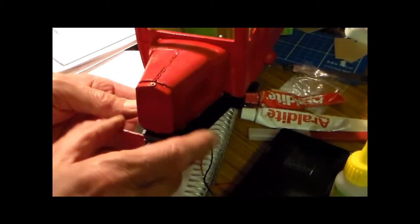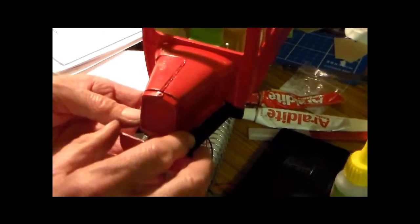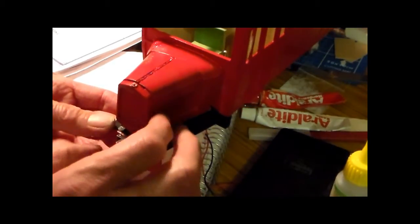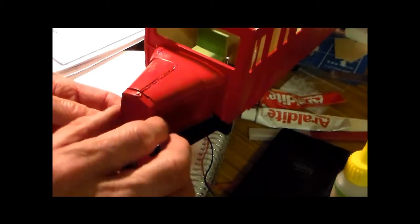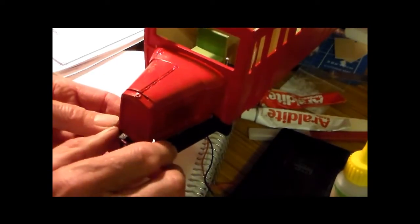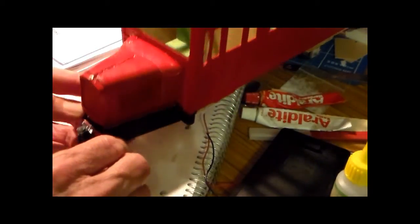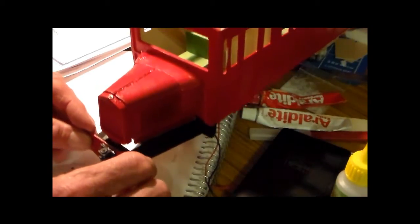My method of fabricating, I didn't solder it. Trying to hold it and solder it would be hard. It is to tack it with super glue, which goes off fairly quickly and holds it in place. You then have to break the super glue joint if you want to reposition it, and then once it's held into the shape, flood it with epoxy glue, which will then make it really good and strong. So, super glue tacking of the die cast metal parts.